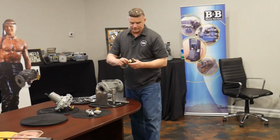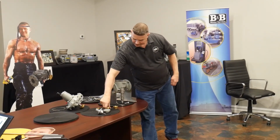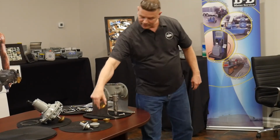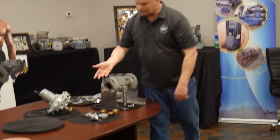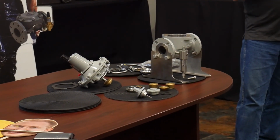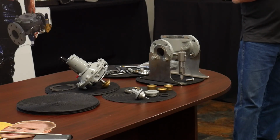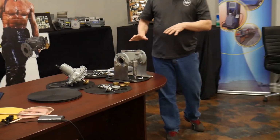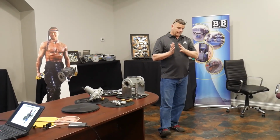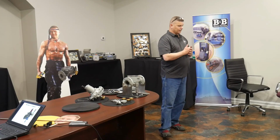50%, a little bit more radical angle. 75%, more aggressive still. That gets me 75%. And then you saw the low flow range extender. So I actually have 5 options of plug retainer, from 100 to essentially 85 with high turn down, 75, 50, 25. In the larger sizes, I have 3. Like a 6 inch, I get the 100, the low flow range extender, and a 50.